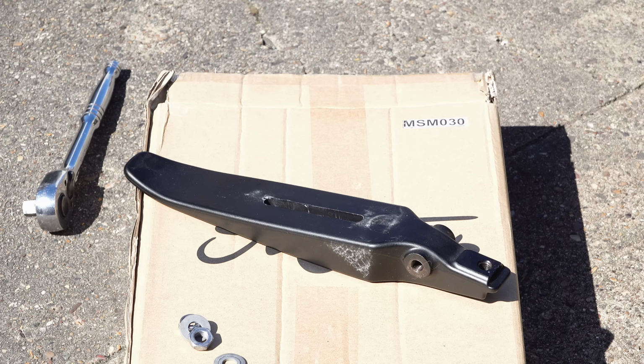The rider's life depends on the integrity of this seat pan, so obviously it needed to be thicker, but that presented another problem, because Motone's metal press wasn't up to the job of pressing the desired shapes on anything thicker than 3mm. And Sam decided for these seats to be absolutely 100% safe, they would have to use 4mm sheet steel. So I had to invest in a whole new set of machinery for the job.